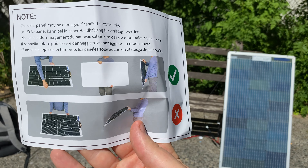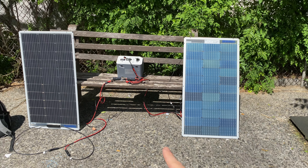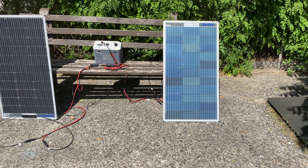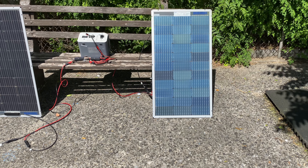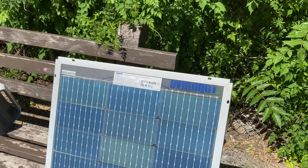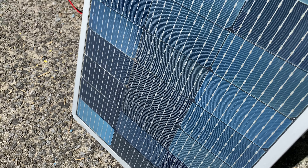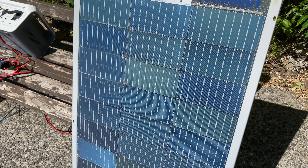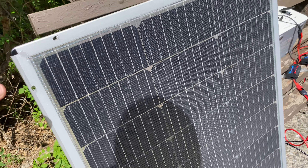This experiment shows the panel doesn't really care which side faces the sun, so a solar fence would work really well. Another idea: there's a roofing and building covering material called Luma Flash. One side is butyl-backed so it adheres to even plywood and makes it waterproof; the other side has aluminum — which is reflective. Possibly, something like that as a roof with a slight standoff behind the panel could boost bifacial output, though in a covered situation you might just go with a standard panel.